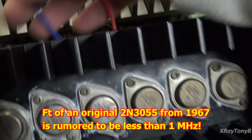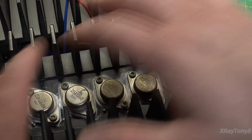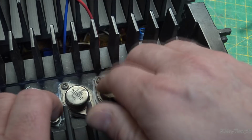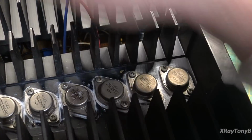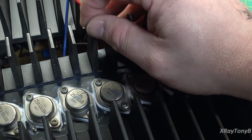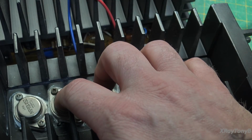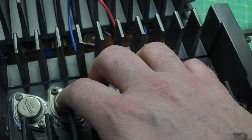So that's why these were designed around this whole technology. Everything in the circuit for this is high frequency transistors, including the outputs. Now, there's nothing perfect in life, and of course everything has its trade-offs. And one of the trade-offs that we're going to talk about is, if this transistor operates at very high frequencies, it can pass very high frequencies, even unwanted ones.